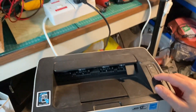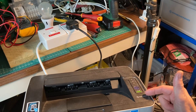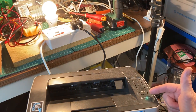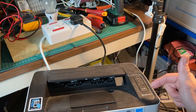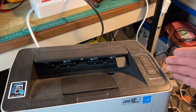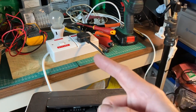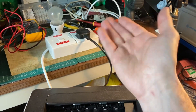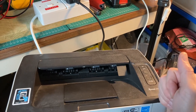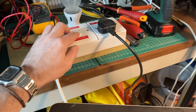Okay, so we get this all in one shot here. This tries to start up — clicks — the relay switches off and it switches off. So this has clearly tried: the on-circuitry, the relay starts up, tries to draw current, it gets capped at full bulb brightness which is about 0.4 amps — insufficient supply — and so it switches itself off.